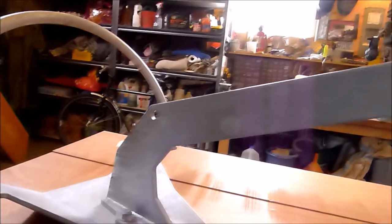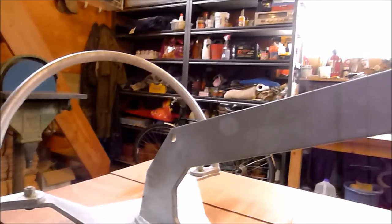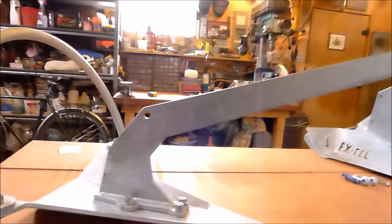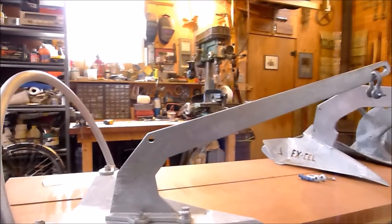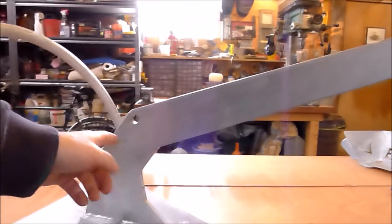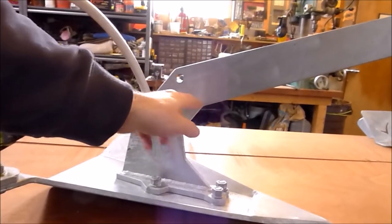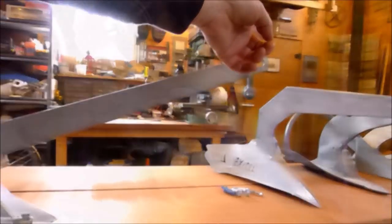Part of the great weight distribution that puts so much weight on the tip and its rapid setting ability, I believe, lies in the fact that there's not a lot of weight in the shank. Now anchor shanks will bend — it does happen even with the strongest anchors — and how strong a shank needs to be is open to interpretation. I've measured the dimensions of all these shanks at the point where I feel it would likely bend. For this anchor, that might be at this area, and it is indeed quite thin and short in height, coupled with a very long lever arm.